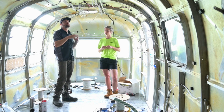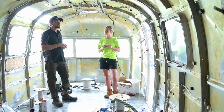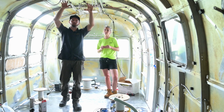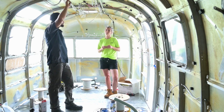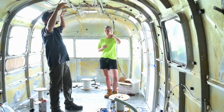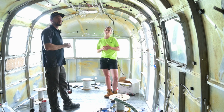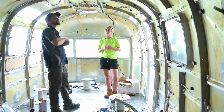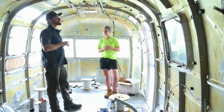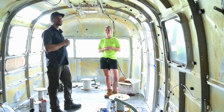So this is a mid-70s 31-foot trailer, and a lot of our electrical, the way that these ribs are, is going to run through the roof of it. That can be a benefit in that if you were to need to access something, you could remove just that center stripe of the skins to get to stuff. Again, in general, most of your wires, once you install it and get the skins up, it's got to be done right because you're not turning back at that point.